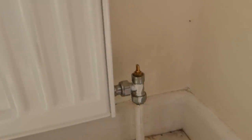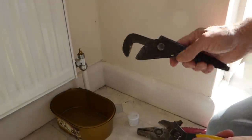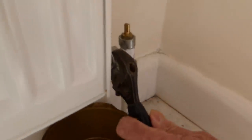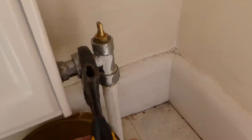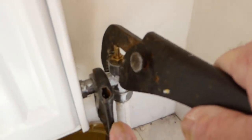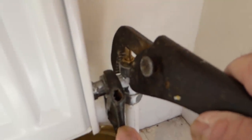Right, so next we're going to undo the unions. Tools I like are just a wrench and a pair of footprints, but you need something to hold against the rad valve. Get your adjustable spanner on your union nut. Now don't just pull that — it undoes this way — and don't just do that because you could break the seal on the radiator. It must be held against, otherwise you could damage that joint. I like to put the grips over the top of the valve. You can put cloth around it if you want to protect the valve.